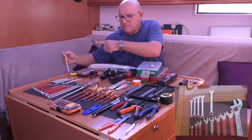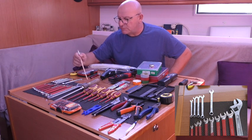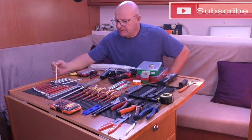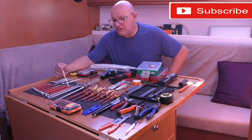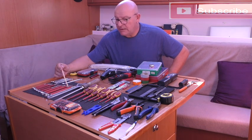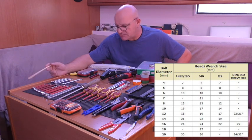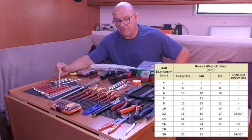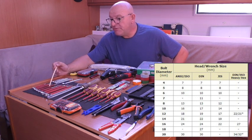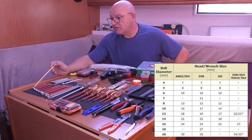We have one and a half sets - why not two full sets? A couple of tips: if you're using metric fasteners with a 12mm thread, the head of that bolt and nut will need a 19mm spanner. After a while you'll be able to look at a bolt and know exactly what spanner to pick up. So: 19mm fits a 12mm thread, 17mm fits a 10mm thread, 13mm fits an 8mm thread, and 10mm fits a 6mm thread. I'll find a chart to put in the corner.